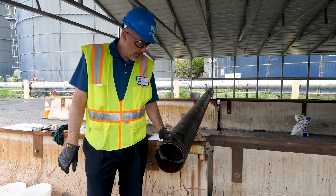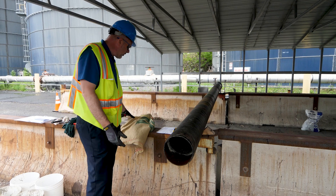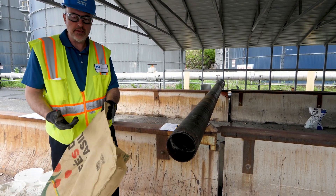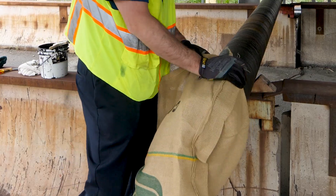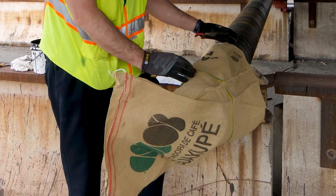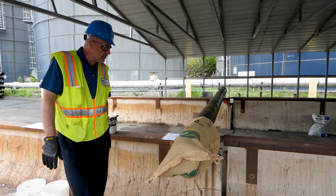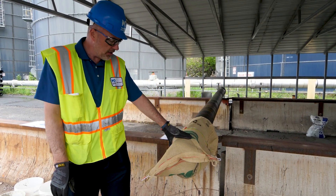Now that we've repaired our pipe and seal coated over the top, we're in the curing stage. Get yourself a burlap bag — we typically send our gaskets in that. Cover over the end of the pipe, secure it in place, and let that pipe cure. No need to rush it into the job just yet. If you let it set overnight, that's not going to hurt anything.